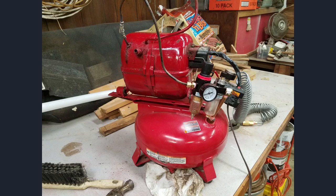The following pictures are after it has been assembled — sorry to say I did not take any pictures prior. I had a compressor that I saved out of an old refrigerator. There's the bracket that I welded to the tank, then I welded this line to it. This is the inlet line and this is the compressor side of the line. Of course, I ran it into an oil separator.